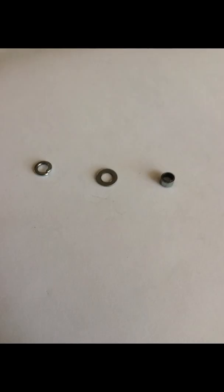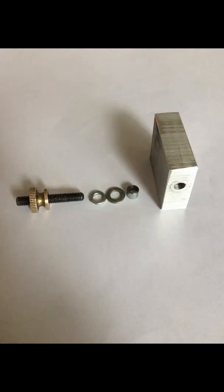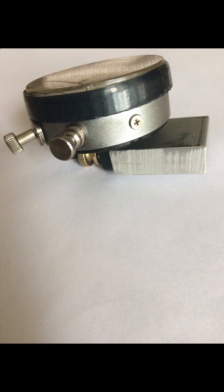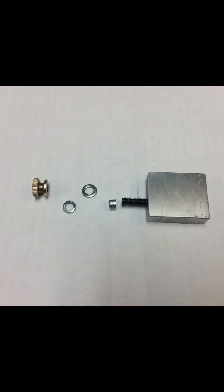To secure the lug mount using a 10-32 screw, I made a simple quarter-inch bushing that I drilled with a 13/64 inch drill to allow clearance for a 10-32 machine screw. After drilling and tapping the hole, I screwed the height adjustment screw into the workpiece until it was snug against the bottom of the hole. I slipped the bushing over the screw, then gently placed the dial indicator over the screw and bushing, securing the dial indicator snugly with a flat washer, lock washer, and knurled nut.